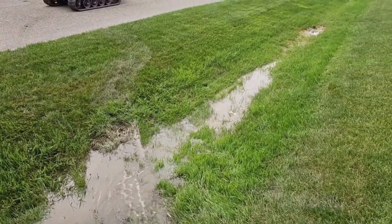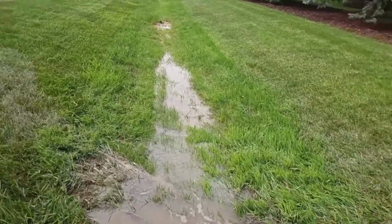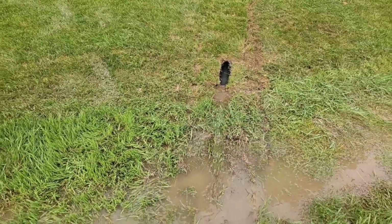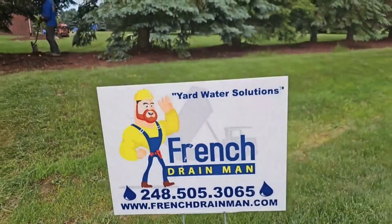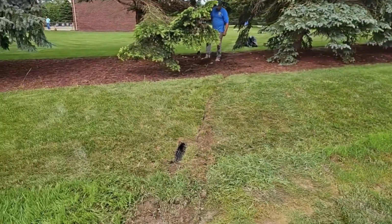When you end the 1.5-inch flexible Schedule 40 short and you let the water just pour in the 4-inch sleeve, it displaces over a greater area, so it mellows it out. That was a pretty good flow of water because that was an M98 Zoller sump pump, and it emptied that 7-foot chamber in a hurry.